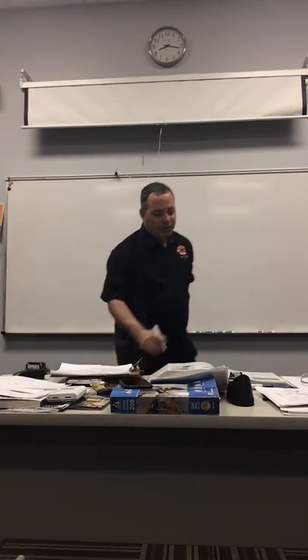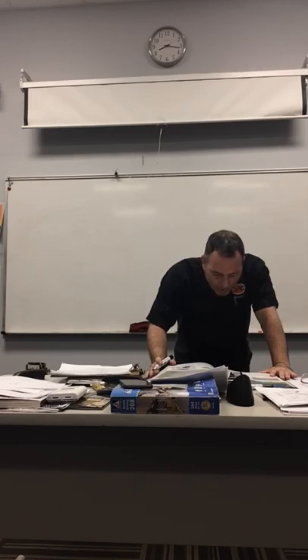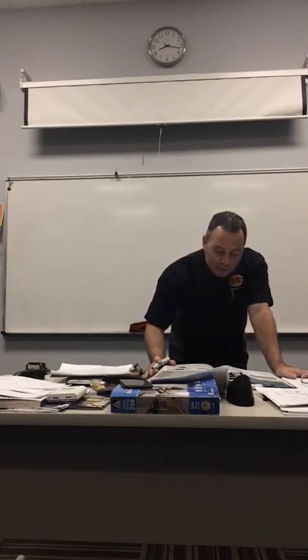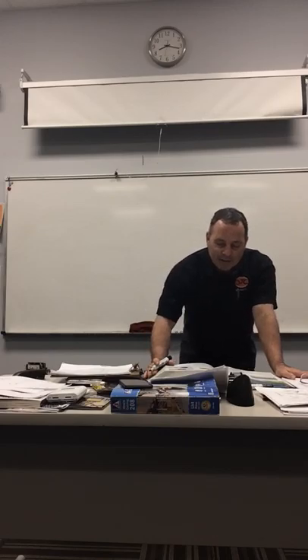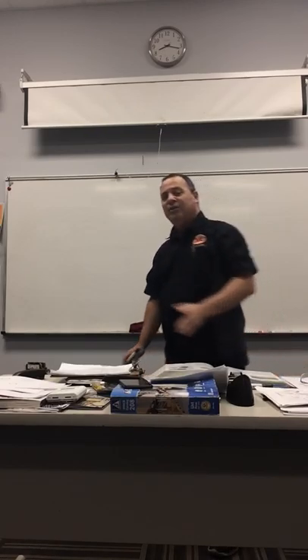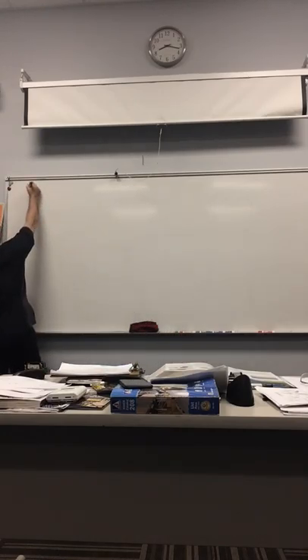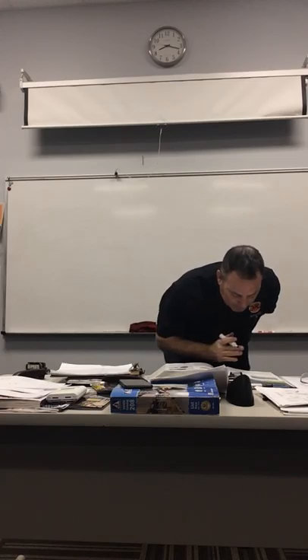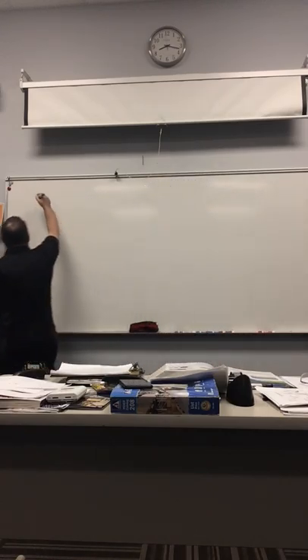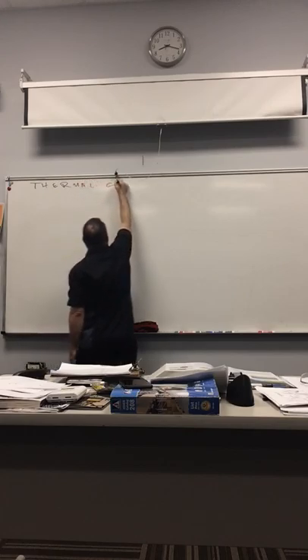Your book says — yesterday we covered types of automatic controls on page 326; today we're on page 327. We went all the way through devices that respond to thermal change. Now let's go back to where we were. This paragraph on the left-hand side at the top of page 327 says the compressor in the refrigerator has a protective device that keeps it from overloading and damaging itself. This is called the overload.